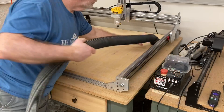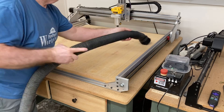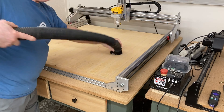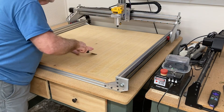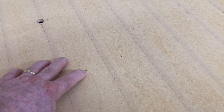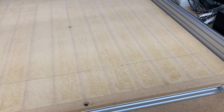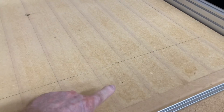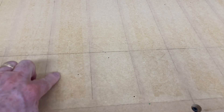It's time for an upgrade. Once all the boards and tape have been removed, it's time for a good cleaning. I've taken out the shop vacuum and getting all of the dust and dirt off this waste board. I'm also taking a putty knife to make sure it's completely flat. The auxiliary waste board was designed so screws went into it rather than into the original base - I wanted to protect this base so I did not have to replace it regularly. The original waste board is now completely flat and clean.